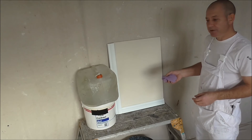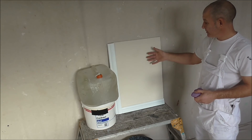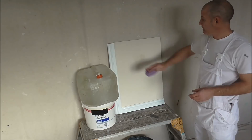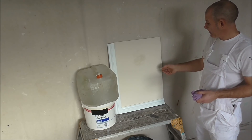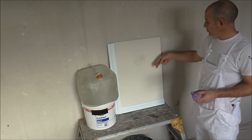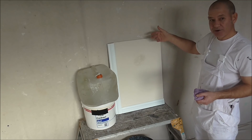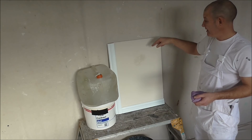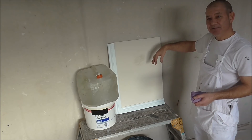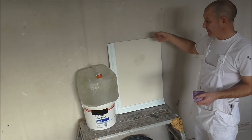With moisture, another problem you may encounter is when you come just to emulsion over this. Because it absorbs moisture, what will happen as you're applying your paint is it starts to get wet, delaminates from the surface, and then just picks up on your roller and starts to come off. There's not much you can do at that point — you can spoil your wall. Best bet, if it's starting to do it all over, is to just wet the paint in and remove it, get the paint off, and then do it correctly.